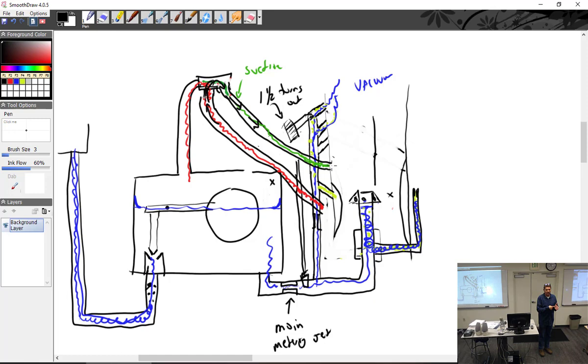So what do you have to do? You're sitting in an airplane running it. You've got to shut it off, get out, and find a screwdriver. Were you able to set the mixture at all? No, couldn't do anything. This is true for all carburetors, especially if you're working on a Marvel-Schebler where you're going to adjust the idle mixture. Follow? Yes. Okay. Can't do a thing because the idle speed is too high.